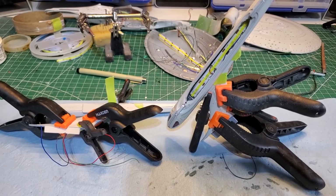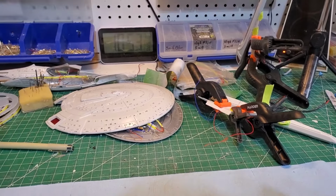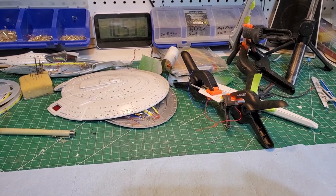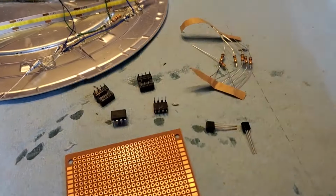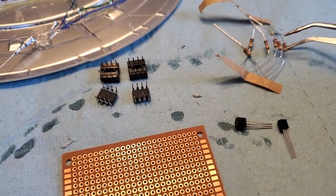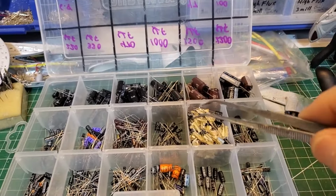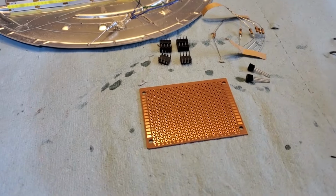Looking good. Not bad. Okay, with those off to the side now, I am going to build the circuit for the flashers and strobe. But I will have a link for the construction of the 555 circuits in the description below. So everything you need to build the circuit is you need the sockets here, 2 555 timers, 6 1K resistors, 2 transistors, and capacitors.